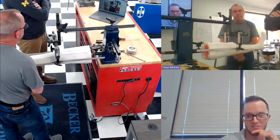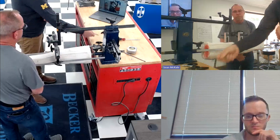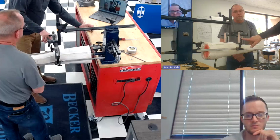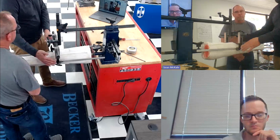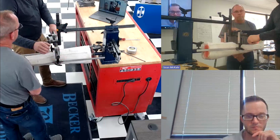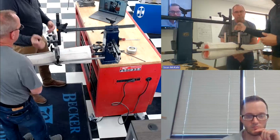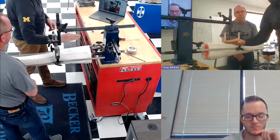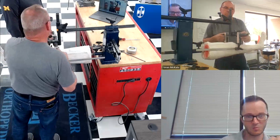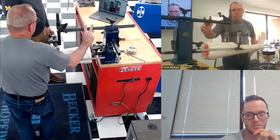The hard part is you don't have the rod to start with that can go through the middle. So you gotta make sure you're at the same point on both sides. That's a challenge, although you just make sure you're set up at the same depth on both sides, which assures you're set up in the coronal plane because of how the bar rotates. So now it's just really that sagittal plane assurance, and that's where taking the one side off, putting it on the other side, making sure your bars are parallel to each other will solve that for you. That definitely helps, because that was the one issue we had with this one we previously made. They weren't quite parallel. But that was a good tip.